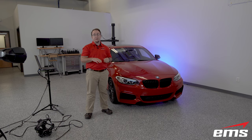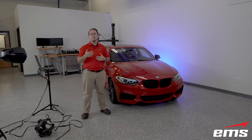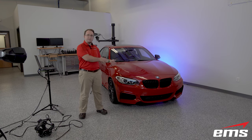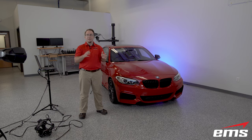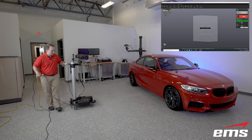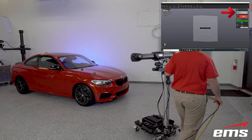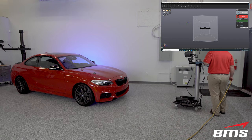Creaform added another significant enhancement to VX Elements called automatic volume extension, available for Gen 3 and Gen 4 models of the Metroscan. Previously, when scanning sizable objects, users would employ a MaxShot photogrammetry device or conduct a multi-step process — setting up positioning targets, detecting them with the C-Track in a stationary position, then moving the C-Track and capturing additional targets, repeating until the entire volume was captured. Now, automatic volume extension allows users to capture all the targets with the C-Track in a single dynamic movement. The user activates the feature, moves the C-Track around the target area, and once the software detects no further movement, target acquisition stops — significantly speeding up the scan process.